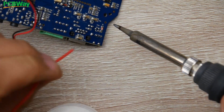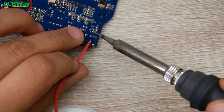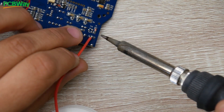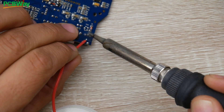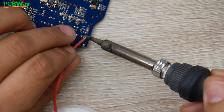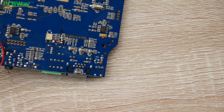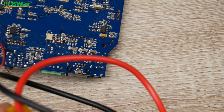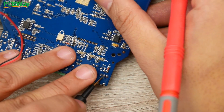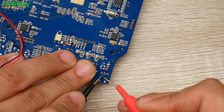If this is too hard or your wire is too thick, you can go directly to the five volt pad — but doing so bypasses the diode. You can verify the diode connection by going into continuity mode again: touch the five volt pad and then the diode, and you can also see the traces making a direct connection from the pad straight to the diode. So I'm going to place my five volt wire right there on the diode. Also double check that none of the pads are bridged together, or you'll fry the board.